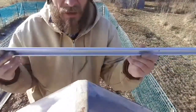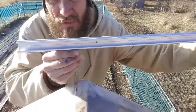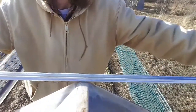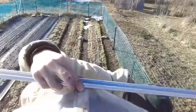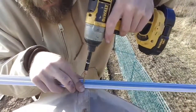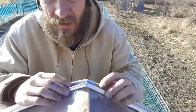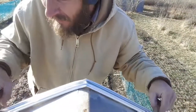Start up at the peak. I take my piece — it's got a bunch of holes in it. Since it's six and a half foot wide, I've got two close to each other. I go over to the middle and then go one off this direction, so I've got one, two, three, and then one, two, three, four. This fourth one right here is the middle. I screw that directly down in my peak, just using one and a quarter inch screws. Then I take and push down and bend it. I get a little crinkle right here, but I'll put a screw on this side and over here on this side, and then we'll take that crinkle out.